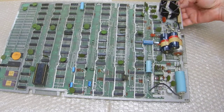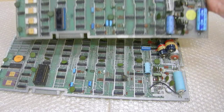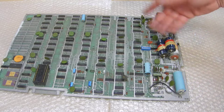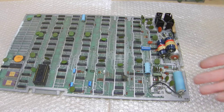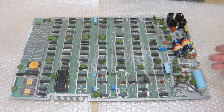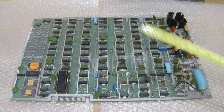Here's another Atari - this is a '78 board. I don't know what game it is, but you can see they're all from a similar era. They didn't reinvent the wheel. Again, linear power supply - have a look, they put more caps on there because they must have had problems, and they used jumpers. They did what they had to do to keep it going. These were out there making big coins - old 20-cent pieces. And I have got no clue why Atari had such big boards. Have a look - tape measure out - 450 by 450 millimetres. Can you believe it?